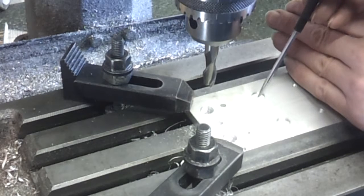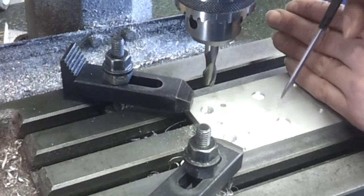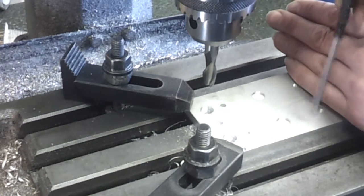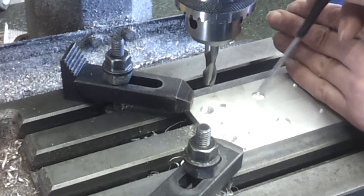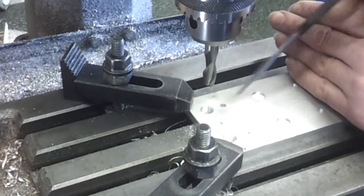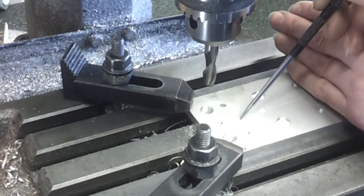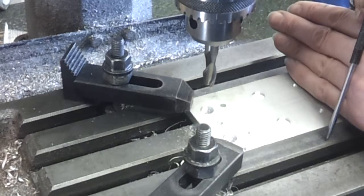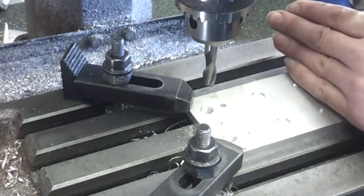These are 1.2mm deep; the magnets are 0.75mm. So allowing a quarter of a millimetre for the shim plate that's going in, plus the adhesive on the magnets, they should be about right — slightly below the centre hopefully — but I can always clock this up and re-drill those if necessary. The next stage will be to put a feed point here with a runner coming down, then take out this pocket 250 microns deep, and then come in and do the slots for the grommet.